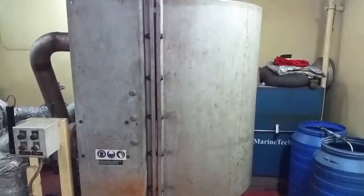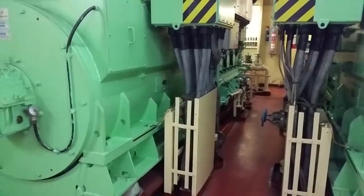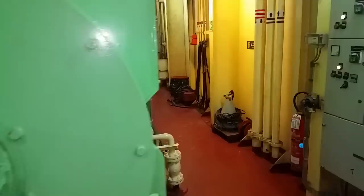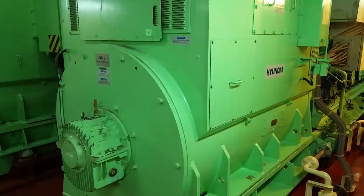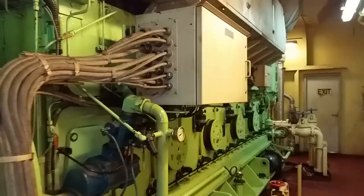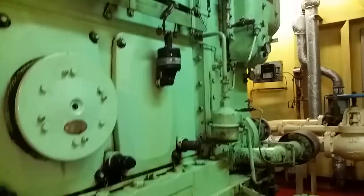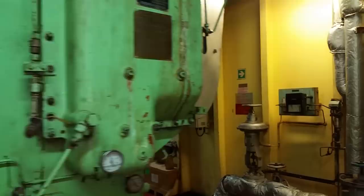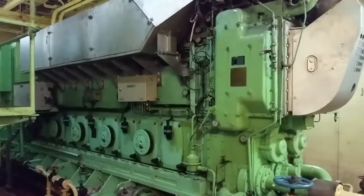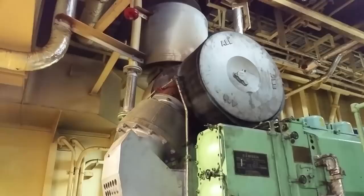We're looking at number three and number four ship service diesel generators — they're nine-cylinder diesel generators. Walking forward, you can see the mist detectors. This is a pre-lube pump for the diesel generator. Behind that cover is the air cooler, just like on the main engine below the turbos — same thing, just different configuration. There's the turbo, with exhaust going up and out the stack, some of it spinning the turbo. You can pause here to see some of the engine specs.